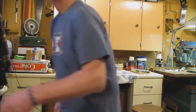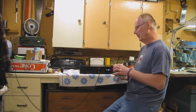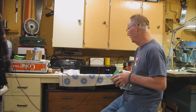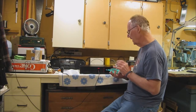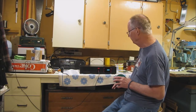There is one that seems to have trouble with the darker colored CDs, so that's leading me to believe that the laser's weak, worn out. And I've actually cleaned the laser. There is a video on the internet where they actually take the laser out, apart, clean the mirror and the underside of the lens, and I did that as well. And still, it still has issues.